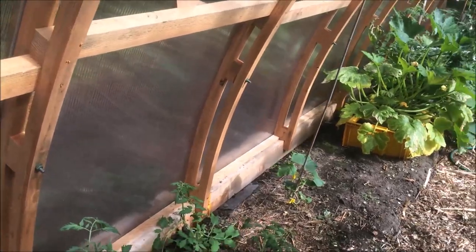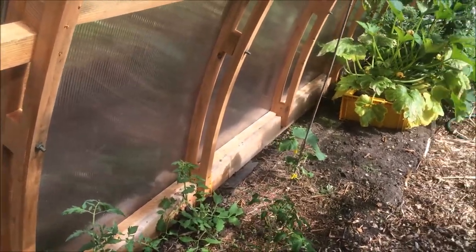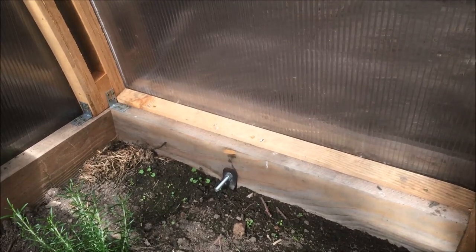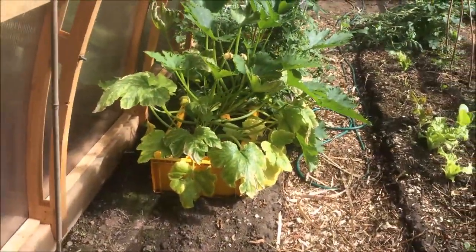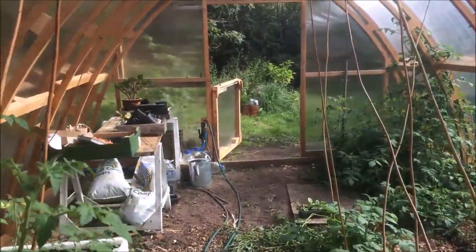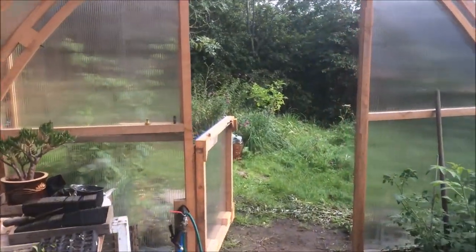The bottom is a big six-inch — 150 by 50 — Douglas fir beam that goes all the way around. The main thing is to get that level and square before you even start, and it's bolted in. These are big screw anchors hammered into the ground and bolted to the structure — super strong, and it avoids the use of concrete which is really nice. I've put blocks and slates in to help level it all the way around. I went with 14 of those anchors all the way around, they're two feet long each and go right into the subsoil — really strong.